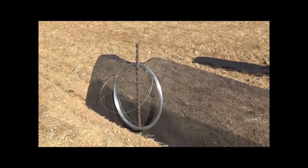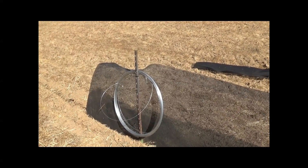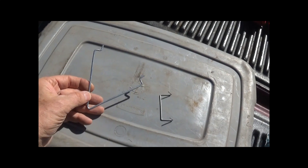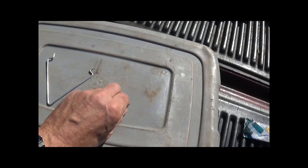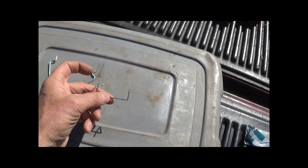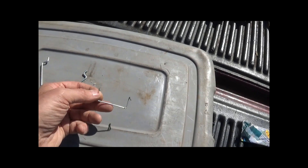When you get to a T-post where the fence stops and there's more to install, just hang the wire on the last T-post until you're ready to continue. The next step is to put on a couple of wire accessories: the climber barrier bracket and the guide wire clip. The guide wire clip pushes through the e-fence and crimps to the guide wire, keeping tension on the fence so that when it blows in the wind the fence can move and absorb energy but stays in place.